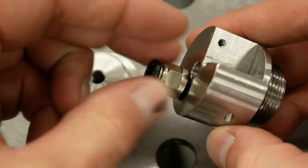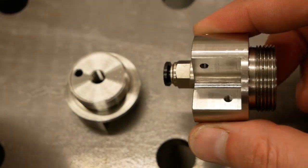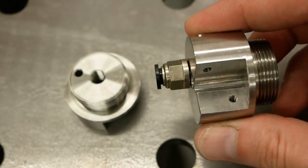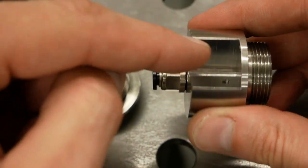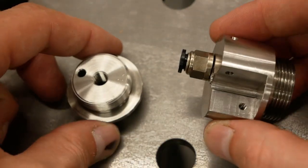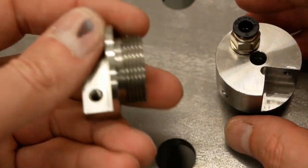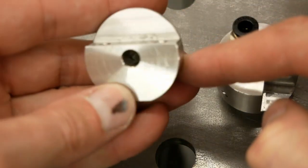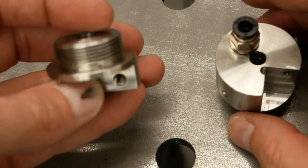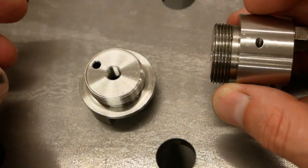You still need to drill and tap two holes, which are the holes on which the flexure is screwed. And it's about the same for the lower one. That one is even easier — you don't need to machine a pocket, you just need to machine this part off, tap two holes, and that's it. So that's it for the wire guides.